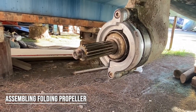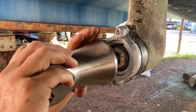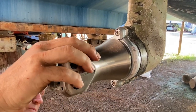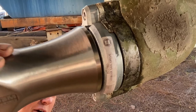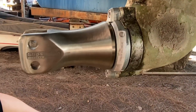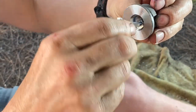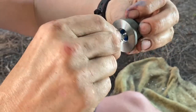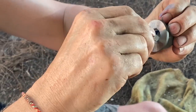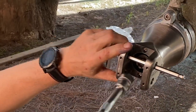The sleeve goes onto that, and the actual housing slides over the shaft. You can see we've got a very slight gap through here — we don't want any prop wrap in there, though there's something you can't really help. If we do get prop wraps, you can always take off the sacrificial anode to get into it and pull it out. The lock nut and the Loctite are supplied by Seahawk. We coat the nut and all that thread with the blue Loctite — with blue Loctite we don't need to heat it. That goes inside the shaft and we screw it in.